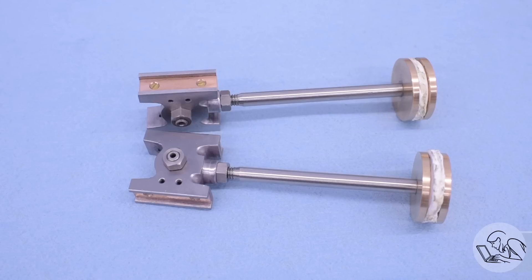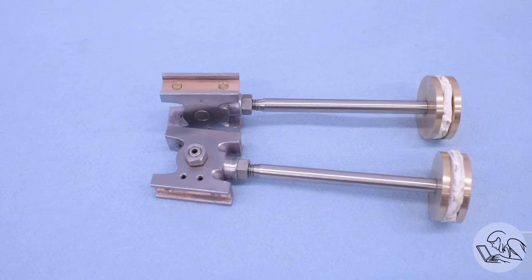These crossheads were very, very difficult for me — I'm not going to lie. I would say these were probably the second most difficult thing I've done on the entire locomotive so far, next to the boiler. You may have noticed some punch marks and stamps on the backs of these. All of these parts are numbered — every time I fit two parts together I number them both so that they stay together in the same orientation and relationship for all time. Because this is a handmade model, even though in theory all the parts are interchangeable, in reality they aren't, and as the locomotive ages and gets used these parts are all going to run in together. In this particular case there are some extra stamps — I actually had to re-stamp and cross out the old numbers on these crossheads because those asymmetrical side threaded holes I said I always screw up? Yeah, I screwed those up — I put them on the wrong side of both crossheads. Luckily the crossheads were identical enough that they could be swapped side to side, so I crossed out the old stamped numbers and re-stamped them with their new orientations. Crisis averted.